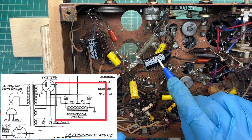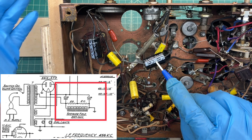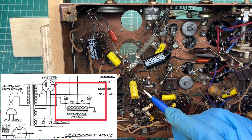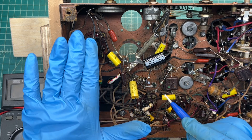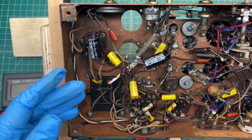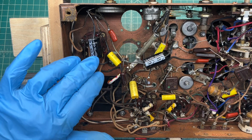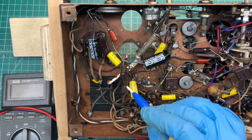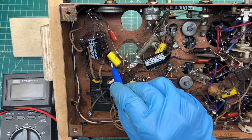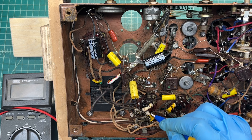Whoever did the repair on the receiver initially with the electrolytics and took the cans out — they have both of them tied to chassis ground, and you can see that's a mistake for the first cap. It should be tied back to the center tab. So I'm going to go ahead and power up the receiver on a temporary basis, and I'm going to denote the DC voltage across this capacitor as it's tied in, and then move it back over here, knowing that both of these resistors are out of tolerance as well.